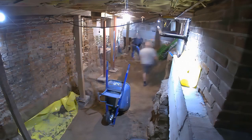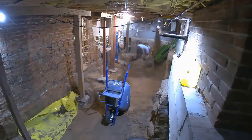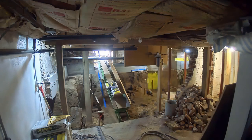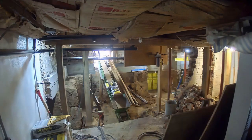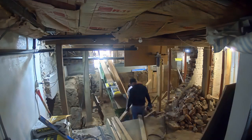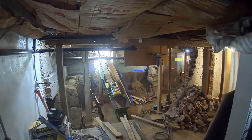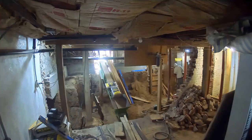We plan on doing a video discussing all the positives of a basement digout that you might not realize — like the fact that you can stay in your house while work is being done. Yes, it is noisy and there's an active work zone under your house, but not having to move anywhere for six months is a win. Back on topic — you can see the guys are building the forms. With these basement digouts they have to build them on site, but it's easy with some two-by-fours and some plywood.